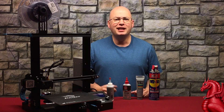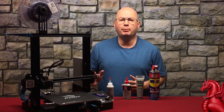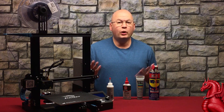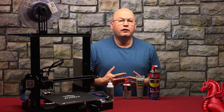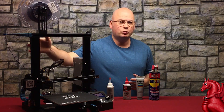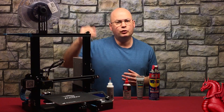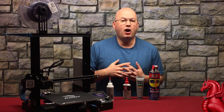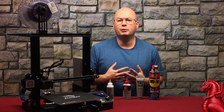Hey everybody, my name is Tom Tullis, this is the Tomb of 3D Printed Horrors, and today we're going to talk about how to properly lubricate your 3D printer. To start with, how do you know what to lubricate? That's easy — it's anywhere that you have metal on metal contact. For pretty much all FDM printers, that's going to be your Z screw, where the captured nut rides up and down on the X-axis and contacts the screw. That causes a lot of friction and will decrease your print quality if not properly lubricated.